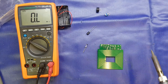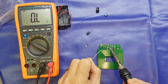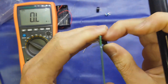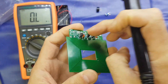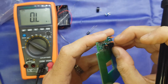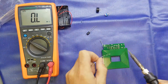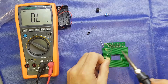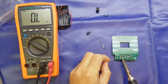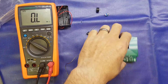When I'm soldering transistors, I tend to solder the middle lead first and do all three middle leads in turn. If you've got a number of transistors, just share out the heat — go between them, do one, two, three, then one, two, three. Just keeps the components from being stressed with too much heat. Once you've soldered up the middle lead, just make sure they're nice and aligned. It's good practice to make sure you work nice and tidy. Then we'll trim the leads off.